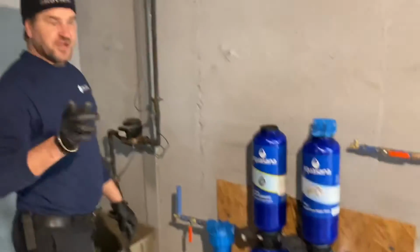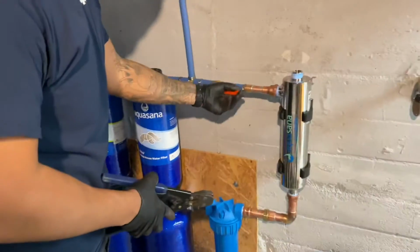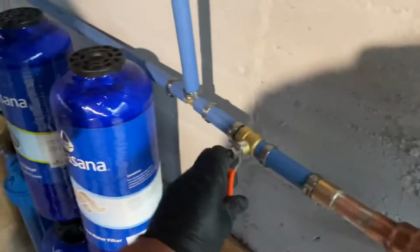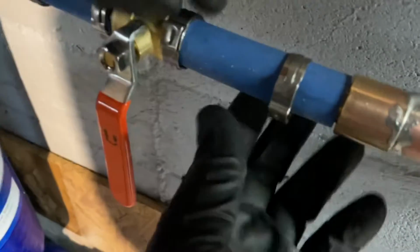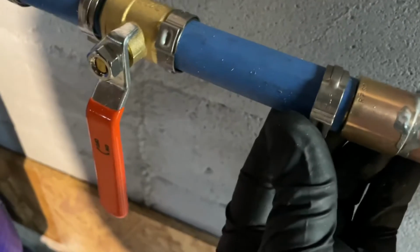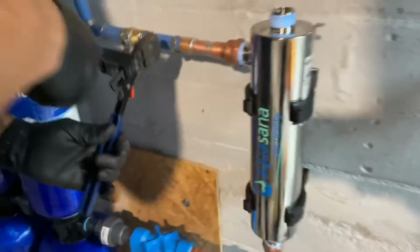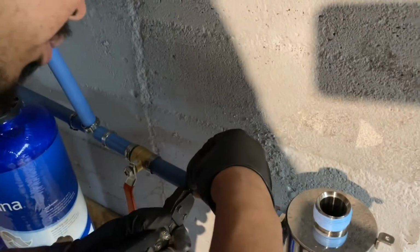All right, I'll grab the PEX. Yes. Everything is good. And don't worry about moving the things around because this will move after the fact. But when you crimp, make sure the PEX is against the fitting and come off just about 1/8 of an inch, like right there. Not too much, not too far away from the fitting. It wants to move on you.